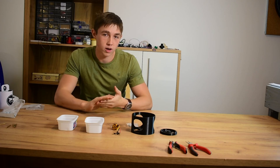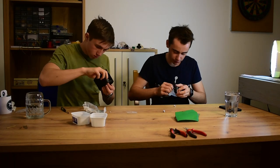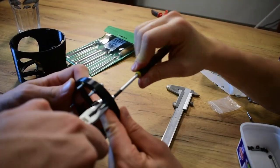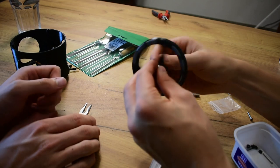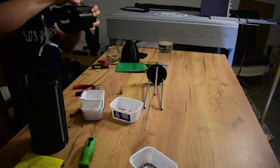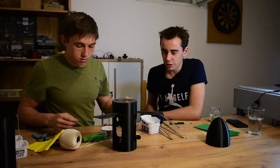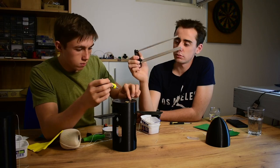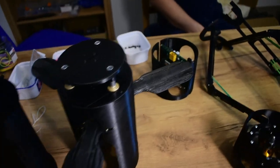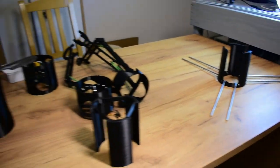The next module we are going to assemble is the gyrowheel module. To be able to fit in all the systems we need, we had to increase the diameter of this rocket to 110 millimeters, which is 64% more than Buffalo Pro's diameter. Consequently, the full stack rocket is also way heavier than Buffalo Pro at around 1.9 kg. The structure of this design is based upon three threaded rods that hold together all the different modules, which has many advantages compared to previous designs. First, we are able to switch the modules however we like; second, we save all the screw connections between modules; and third, the structure is way more robust.